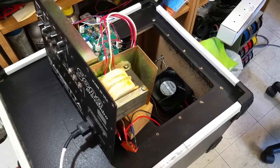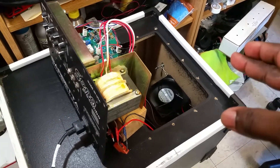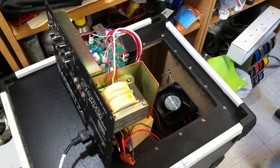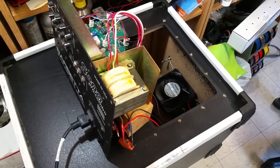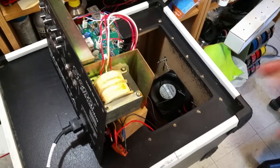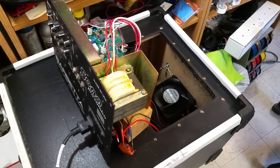How do I know? Because I was using an external fan up against this portal, and as long as I used that fan to blow air into the case the amplifier would not cut out. So I decided to go ahead and install a fan in here to take care of the issue and not have to use an external fan any longer.